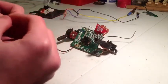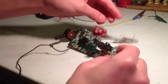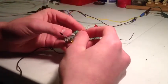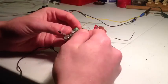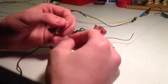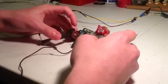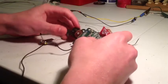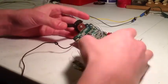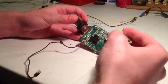You can strip these ends down and put alligator clips on it like this, and then just clip on your commercial grade e-matches, or if you make your own. I'm going to be showing you how to make your own in a future video, so look out for that. You solder the alligator clips on, then hook your e-match up to that. If you pick the wires that go to the driving motor, it's going to be the throttle that you'll use. So you turn this on with the e-match connected, and then you just push the throttle, and that'll send a signal to this, that'll make electricity go through these wires and light the e-match.